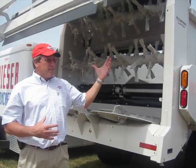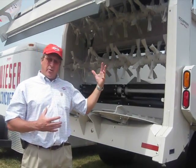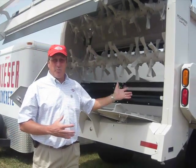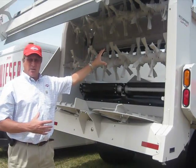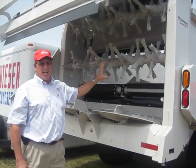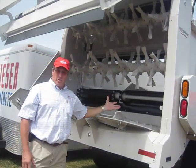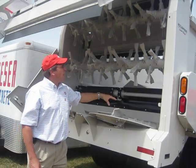The Accu Spread is something new we've come up with. For the Pro Spread series and the Pro Spread commercial series, we now offer three different choices of beater options. The two others would be standard horizontal beaters, or we can go with a vertical beater. The Accu Spread is basically two horizontal beaters inside of the shroud. The shroud is lifted up now, which would be more of a maintenance and cleaning aspect — the shroud would normally drop down.